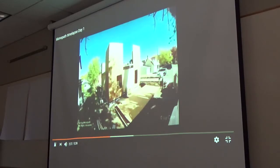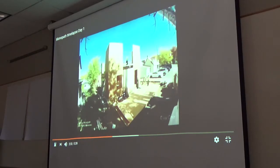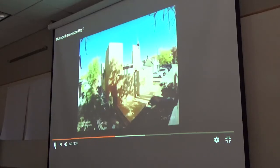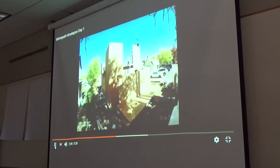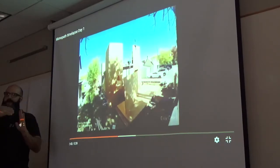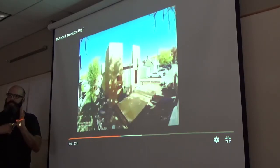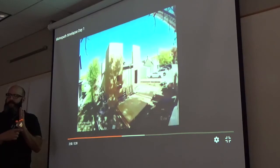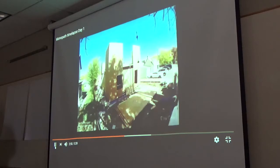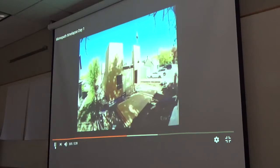So you can see them flying in the panels for the subfloor. And then you've got the crew up there getting all the screws put down. Okay? So the trusses are sitting on top of the interior panel on either end, but they're just bearing on the edge of that, or is there a ledger on this one too? There's a screw pattern. There's 4 structural screws through the outer panel into that, right? With the exception of the infill panels that they'll have to put in at a later time. So those trusses are just hanging out until they get the subfloor. Independent of the exterior, that's right.